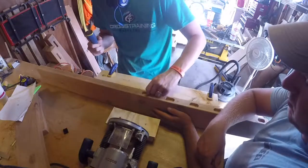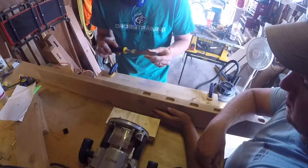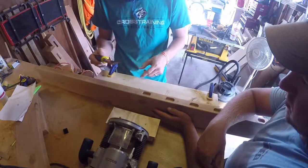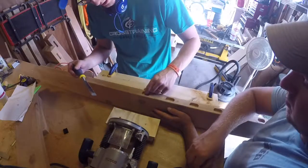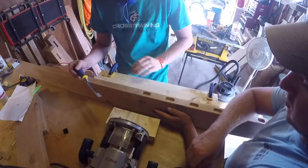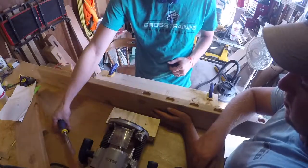That's how you do that. It's pretty simple, but going across the grain these chisels aren't super sharp or super great, so it doesn't come out crisp and clean and nice looking. But it doesn't particularly matter since it's going to be on the inside of the wood and you'll never see it — at least that's the idea.